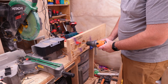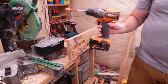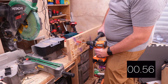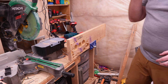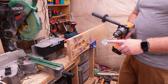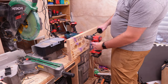Now we're doing the RIDGID with the one inch speed demon bit going through standard two-by material. The hang-up at the end is when the back material breaks away and sometimes binds up. This drill does have anti-kickback control, so we may start seeing that trigger. We'll add the auxiliary handle and give it one more test. We got the same bind-up on the back end but it's essentially through. The Milwaukee powers through — arguably a little bit slower, but without stalling. Now for the inch and a quarter spider spade bit — it goes through in speed two with the lower amp hour battery, which is a good sign. The RIDGID punched right through, and I think it's a little bit quicker. Now the inch and a half on the four amp hour battery — it got bound up at the end but there is a complete hole. The Milwaukee punched through just like the RIDGID.